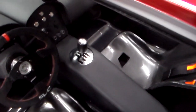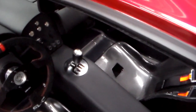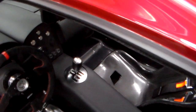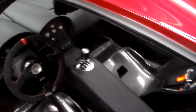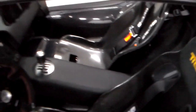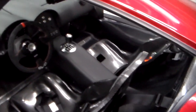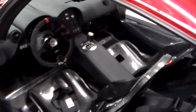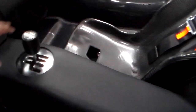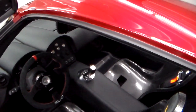Now, one of the most outstanding parts of this car is it's got a Graziano transaxle, which is used in the Audi R8, and this car has an R8 shifter, a gated shifter. And it's much higher and much wider than the standard shifter in the SLC, so I had to really push my fiberglass skills and make a mold and make a center console. And you see it in there, shaped to the body and making the balance between where the tub goes and how wide that is, and all the way up to the 6-inch wide shifter. So it's gated, but it feels real comfortable, and when it drives, it just goes into gear nicely. Reverse, you have to push down and move over and then into gear.